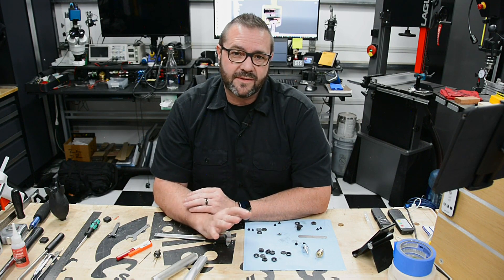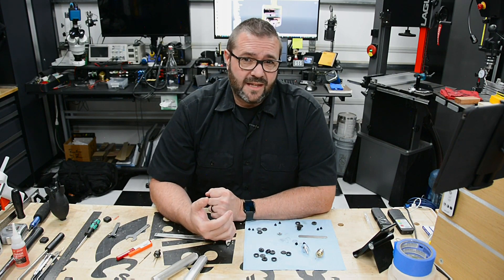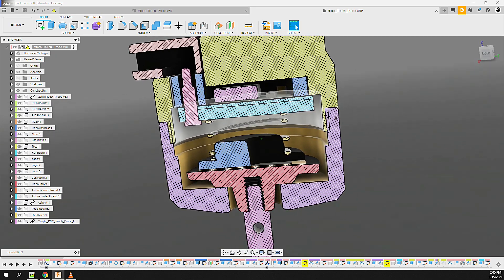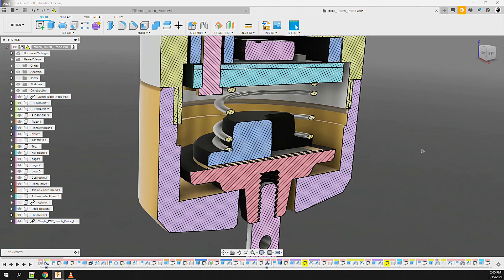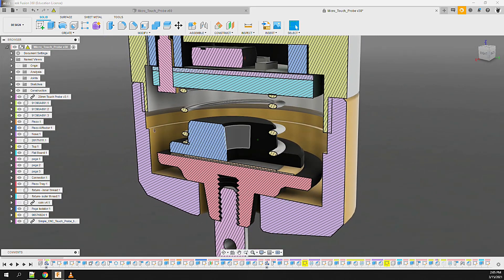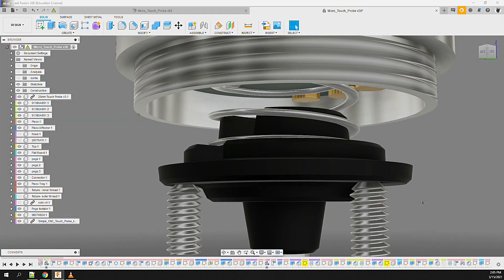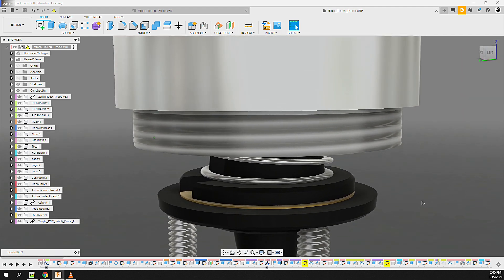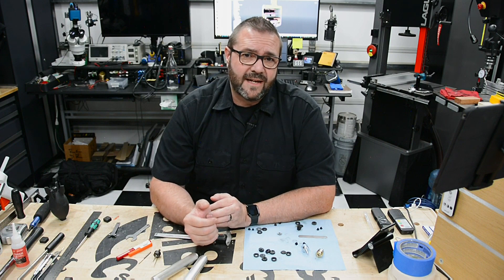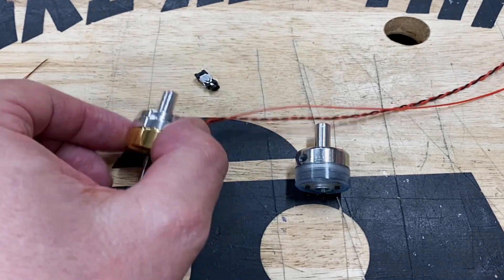The problem with my design was that the piezo tray supported the piezo too much - so well that it wasn't allowed to flex enough to trip the Schmitt trigger without significant force. The result was much less sensitive than designed. The design was a piezo sandwiched between a platter and an effector, with a spring applying pressure between the two. When the platter moved, the effector would cause friction on the piezo. Unfortunately, the piezo platter was flat, didn't suspend the piezo or allow it to flex, and as a result the minute touches did not deflect the piezo crystals enough to produce the threshold voltage required by the circuit. This was primarily caused by the spring strength and the lack of a void underneath the piezo to allow it to flex.